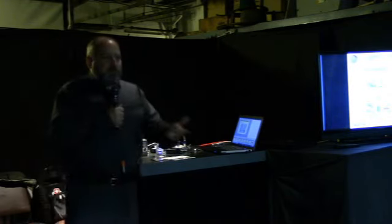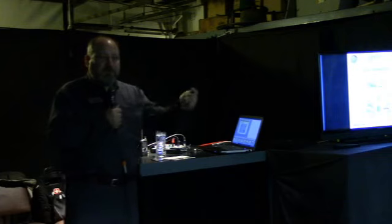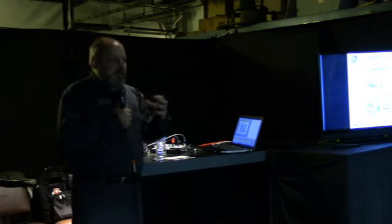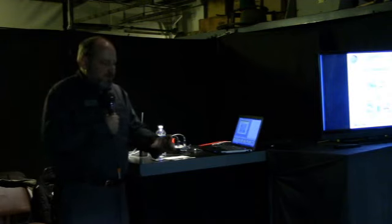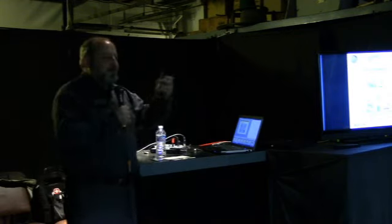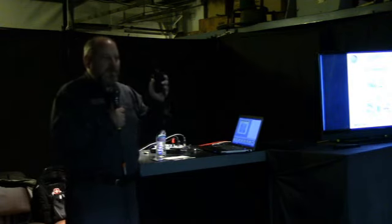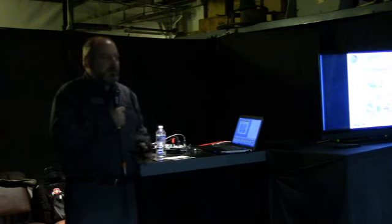The other nice thing now is that Internet Labs has also created the DV dongle, which we'll talk about, which lets a random user over an internet connection connect into this system, and they can talk to an RF user. So from a laptop in a hotel room using free Wi-Fi, you can talk to an RF user somewhere else. There's also these DV hotspot things that they've created. I've seen a lot of guys do this. I'm not sure exactly what the virtue of it is, but they'll put a hotspot in their hotel room, connected to their laptop, connected over the internet, and they can use their DSTAR radio to talk through this little hotspot out to another RF user. So it's RF to RF, but it's using a little tiny hotspot device. So it has limited range, quarter mile maybe.